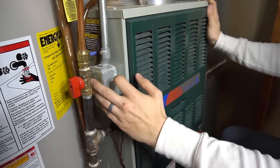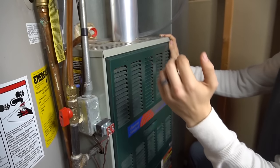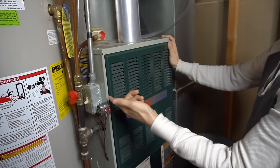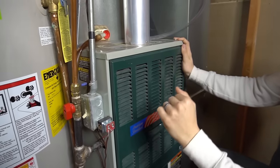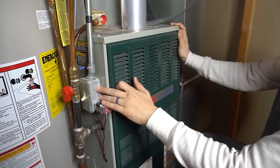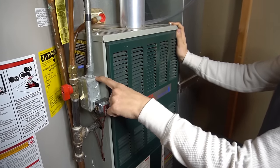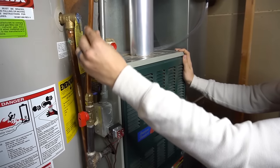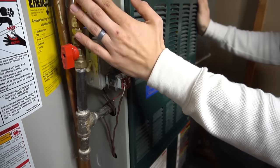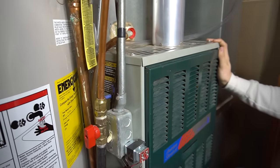You'll have power coming in — either a rigid steel cable or a solid one. There will often be a power switch right at the furnace or further down at the wall. Trace the metal cable from your furnace to find the switch. Occasionally there's no power switch, in which case you'd turn off the circuit breaker.